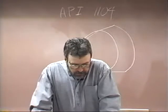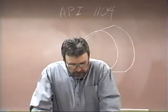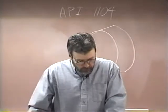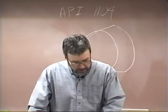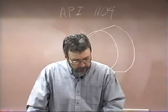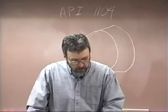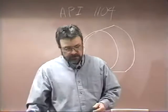Several different grades of steel are used in pipeline construction and are designated by the API standard as X42, X52, X56, X60, and X65. The alloy content in these pipes increases with an increase in the number designation. The tensile strength and other mechanical properties also increase in the higher numbered pipes. This progressive increase in properties is the result of the greater alloy contents, principally carbon, manganese, and perhaps silicon.